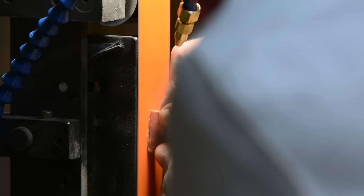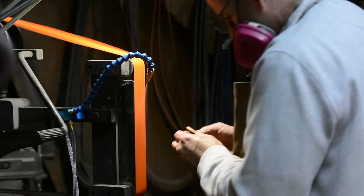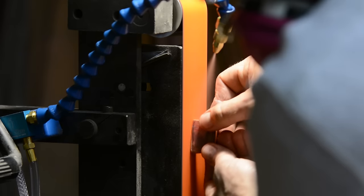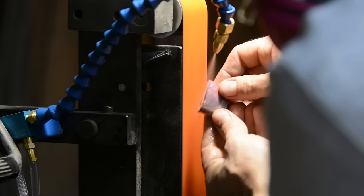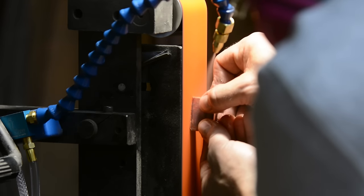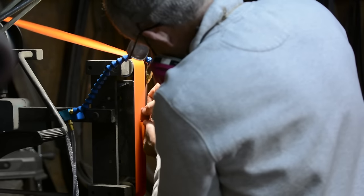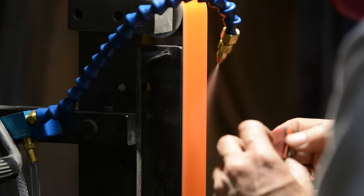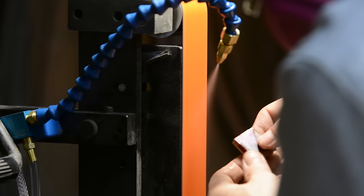It's also fantastic for small parts — fittings, bolsters, pins, guards, things of that nature. I use a grinder to rough out small copper fittings called habaki that act as a little collar on Japanese swords. Copper conducts heat like crazy and the parts are really small, so they heat up in literally two or three seconds and you've got to dunk it in the bucket. It's sort of grind a little bit, then into the bucket, grind, into the bucket, burn your fingers, drop it, curse a little bit, pick it up in the bucket. Cool Mist just completely takes the finger burning, dropping, and cursing out of the equation, and as a result I probably saved a good 15 minutes of grinding on this little sucker — maybe even a bit more.